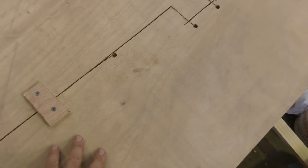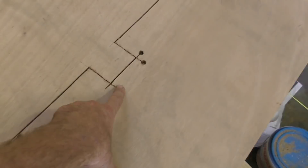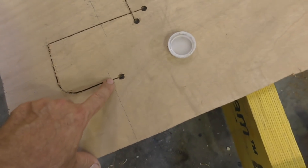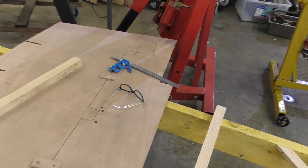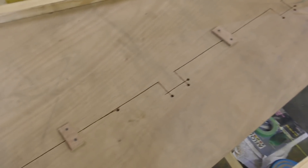It's now Sunday afternoon. I've just been out filming this morning for my motorcycle channel, so we're running out of time this weekend. We'll put up this next bulkhead, but before I do, I'll just show you something that I didn't really film when I was cutting them out. Although you need the bulkheads complete like this — because they have to sit at their correct height, and this little addition here is what gives them the height — all this is actually going to get cut out once the boat gets flipped over. So what I've done is pre-cut it all, except for one last little bit here, and then put a few butt blocks on to hold it in place. That way it's really easy to cut this out — one cut here, one cut there — once the boat's the right way up. That's something I probably should have shown in the first video on cutting the bulkheads out.